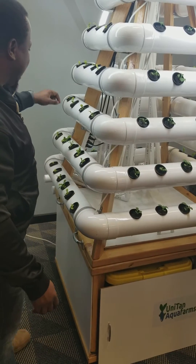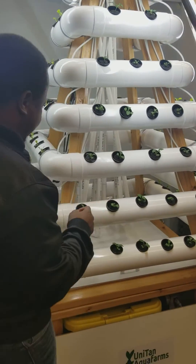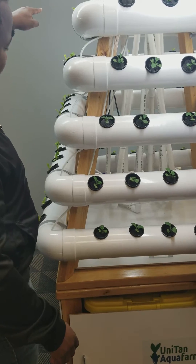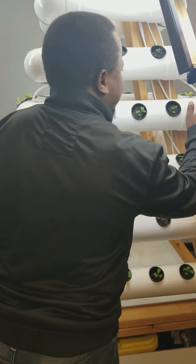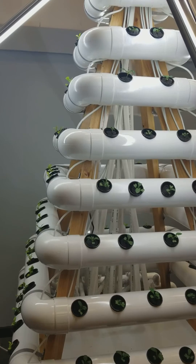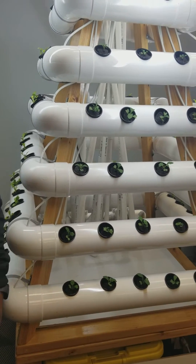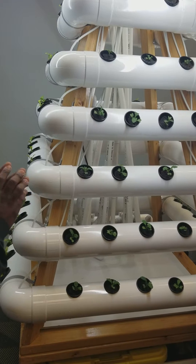The pipes are also color-coded. If you look at all the systems here in the front, you see colors — these colors will match the back. Just follow along the side of the system and you see the color, which will match the drains in the back and the valves themselves. That way you know which one you're draining — if you look at the green and come back to the green, you're draining green. The valves are used when you want to drain it completely.